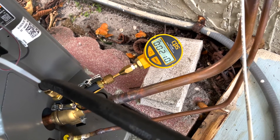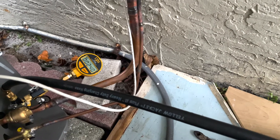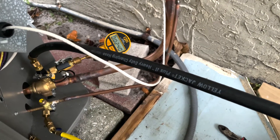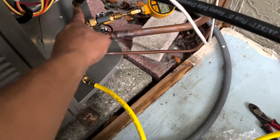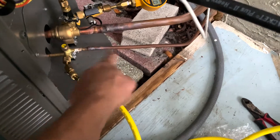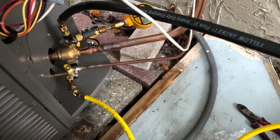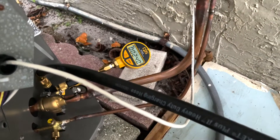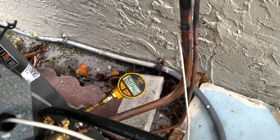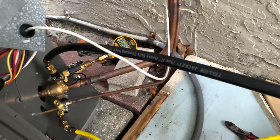After 10 minutes the reading is at 240 microns. The reason it rose slightly is because I have a TXV on my air handler — the restriction meant most of the vacuum was being pulled from the suction side, and the liquid line had less vacuum due to the smaller hose. Once the pump was off, the vacuum balanced out across the system, which caused the slight rise. At 240 microns with no movement after 10 minutes, this is a good vacuum and we can go ahead and release the refrigerant into the line.